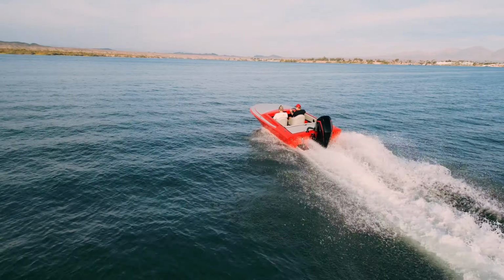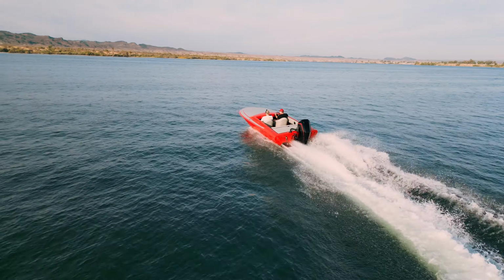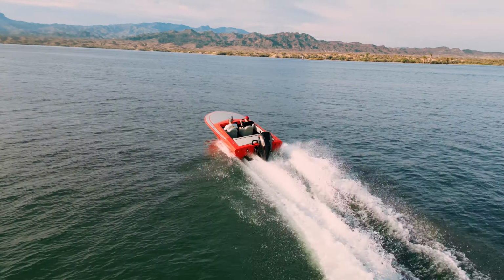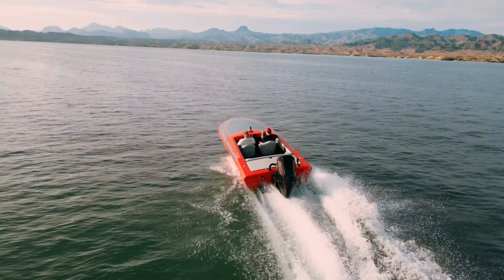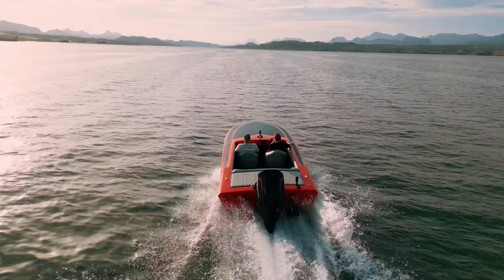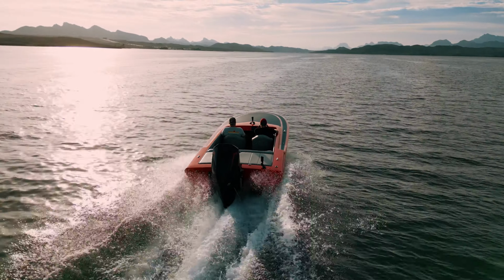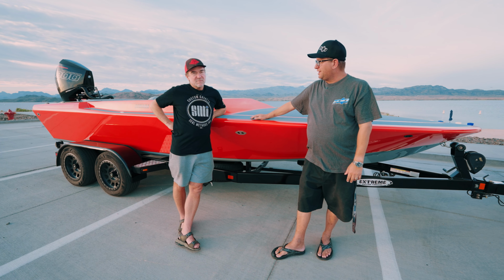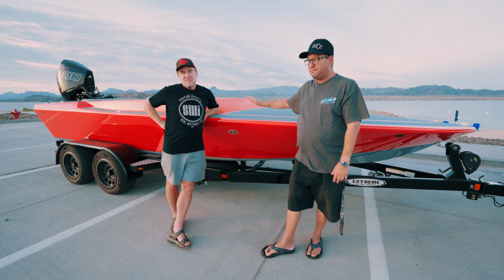So what he's saying by that is they took the original mold and they did an insert. It's basically two steps, and they changed the angle of attack on the bottom so that the back of the boat is getting smaller than it used to. So instead of the air just going straight through and out, it's compressing it harder and harder, and they did that to carry the weight of the new outboards. The outboards are 4 strokes now, and they're getting bigger and bigger, and so they modified.